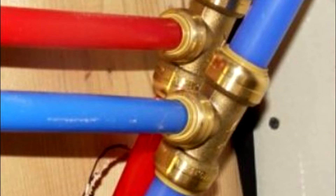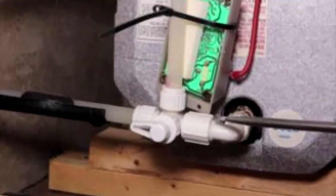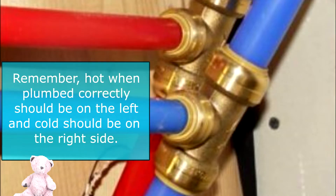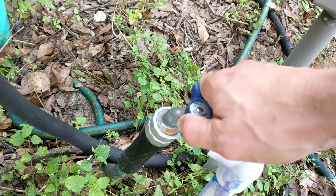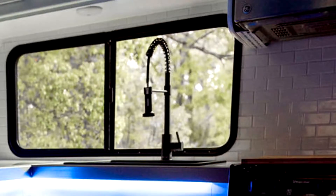But if you didn't do that, go to your water heater and shut off the valve next to it. That will shut off the hot water through the whole RV. One of these two pipes will stop running water, thus indicating which one is the hot water pipe.